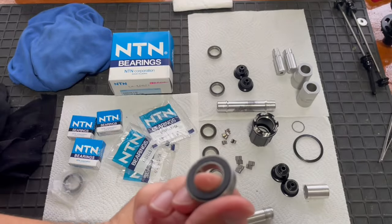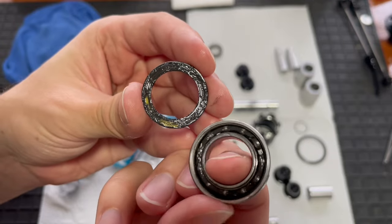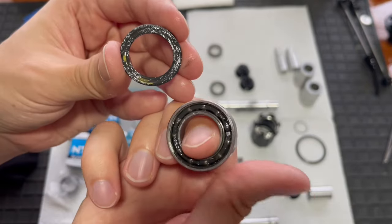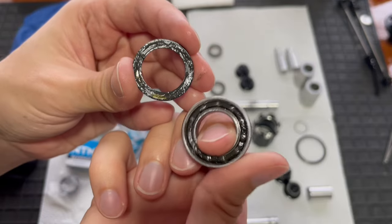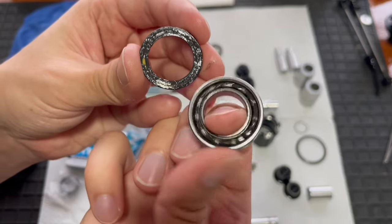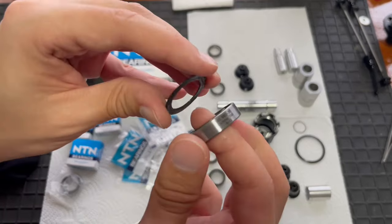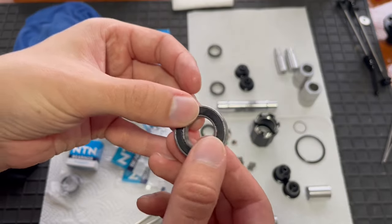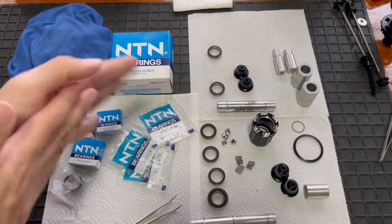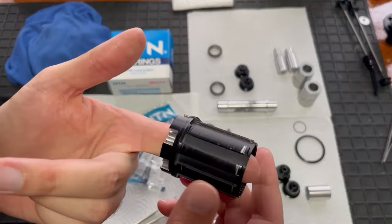Although I'm not going to reuse it, it has suffered a lot less than the others. However when you open it up you can see how dirty it is - all that blackened dirt is silicon nitride from the ceramic balls wearing away at the steel race, creating what looks almost like soot. Basically all the bearings are due for replacement as they're not performing as well as they should be.